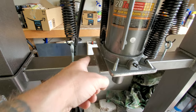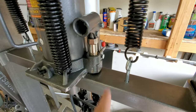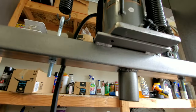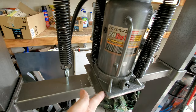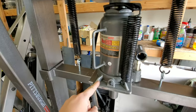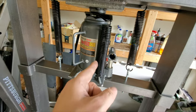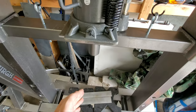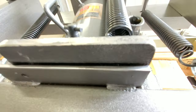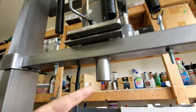We've got it pretty much parallel with this edge, and this edge is flush both in the front and back. We've got to weld this edge right here and this edge right here. One of the focus areas is making sure it is centered side to side and front to back so this is just getting a straight-down push when it presses. We've got some alignment marks here, and then we just have the black line where we're going to need to grind this all down before we weld it — same thing on the other side.